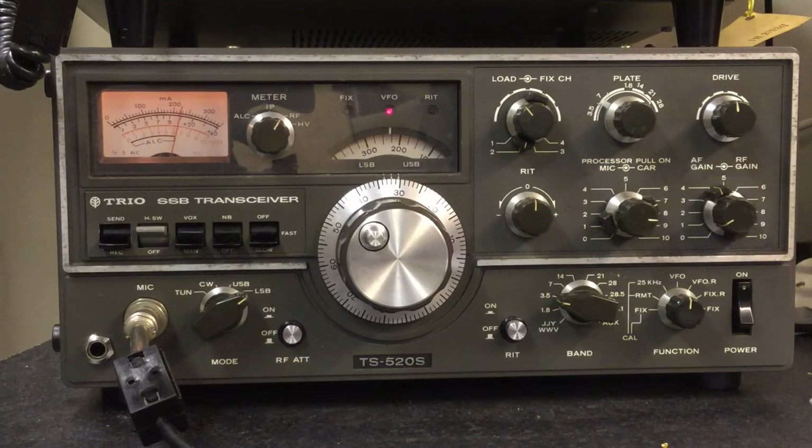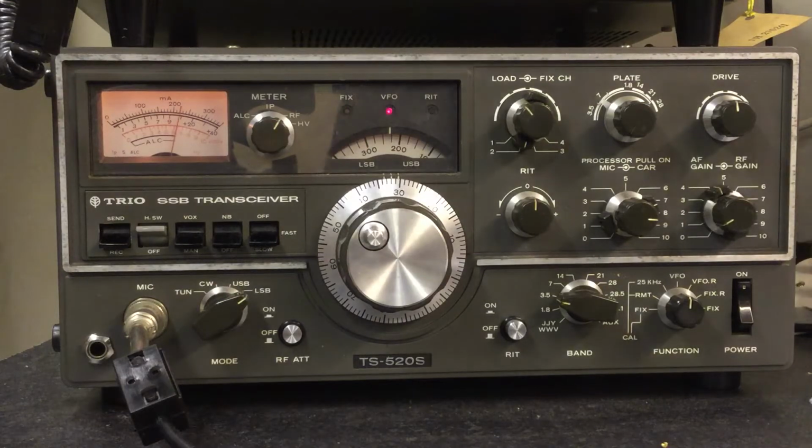It's just the home location. I'm troubled with all sorts of things, VDSL interference, Wi-Fi interference, and all sorts here. But most nights I've got an S9 of noise on 80 metres, 40 metres and 20 metres. So anybody I work, they've got to be 5 and 9 plus 10, he's on the safe side. Now and again, and it is very rare, it goes down to about S5, S6. Those days I've got a feeling are long gone now. I've also got interference on 2 metres as well, but you probably know all about that.